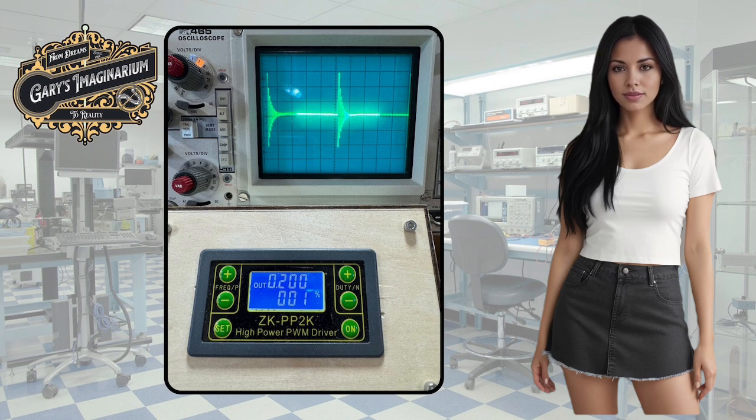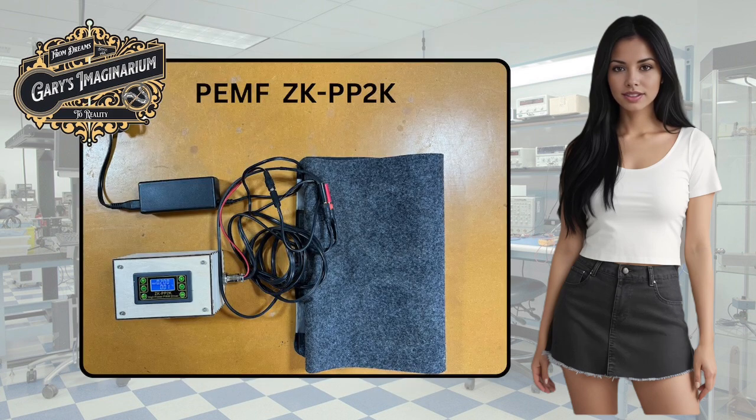Consequently, we will need to incorporate a microprocessor like an Arduino to meet these specific requirements. Even though the test results indicated that the ZK module is not suitable as a PEMF device, we recommend building one yourself to discover the optimal resonance for your specific coil configuration. If you design it with a single connector for both the power in and pulse wiring out, you can utilize the ZK module to determine the resonance of your coil set and integrate it into your final design. In the next video, we'll cover the building of a safe PEMF device utilizing an Arduino microcomputer, using the same mat and power supply.